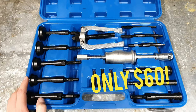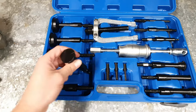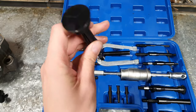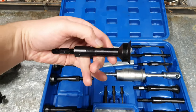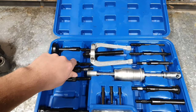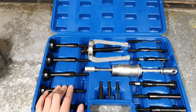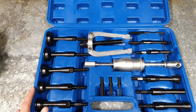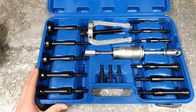Would you look at that! So we got all these different size adapters. The way this system works, you got a split collet. As you screw this stud in, these three fingers will spread out. This lip right here will grab on the inner race of the bearing, and you attach the slide hammer to it and pound them out. This particular set has a range of 8 millimeters to 53 millimeter diameter — that's roughly 5/16 of an inch to a little over 2 inches — so that'll be the ID size of your bearing that you'd be able to use it on.